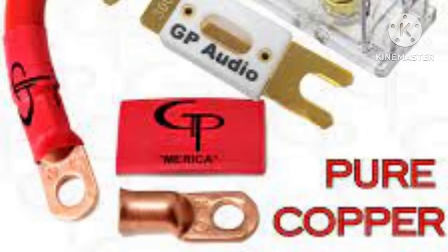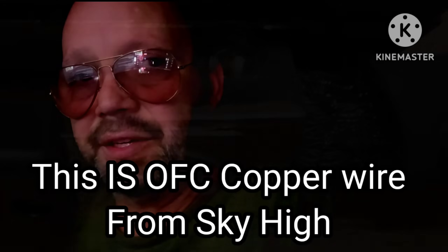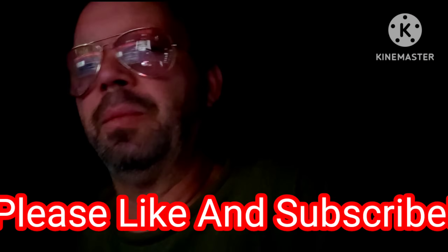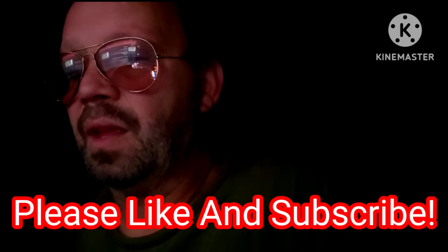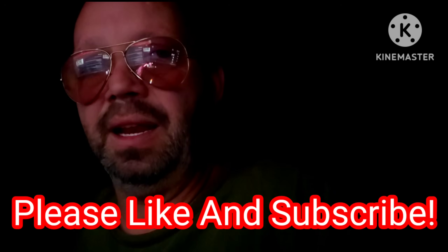The moral of the story is a good solid connection that is tight and maintained tight — using good crimps as well, because a bad crimp can create a loose connection at the end of the wire. If your cable is running into your lug and the crimp is weak with not a lot of conductivity, that lug and crimp combination can create heat too. The problem can come from a loose lug, a badly crimped lug, or a loose bolt — anywhere two conductors are touching but not solidly connected, you're going to get heat, and it will snowball.